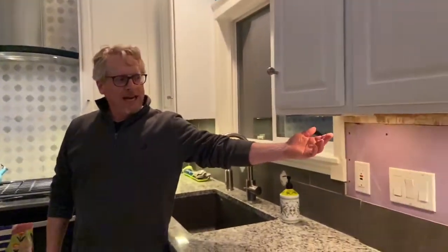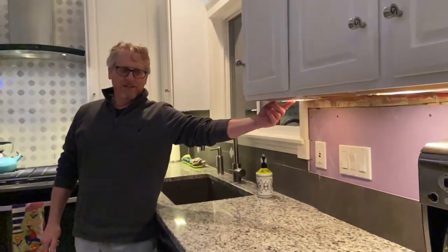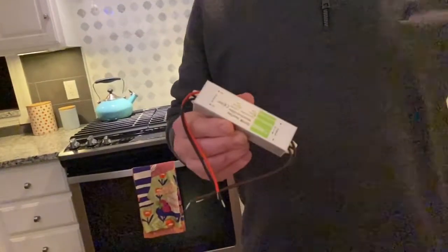What you have to do is use a little transformer that takes 120-volt AC current coming into these lights and converts it to direct current — that's what this component is for. You need these LED drivers to replace the existing driver in order to run your LED light bulbs. That's what we're going to show you how to do today. It's pretty simple — just replace these and then you can run LED lights on these fixtures.